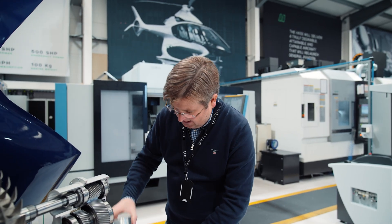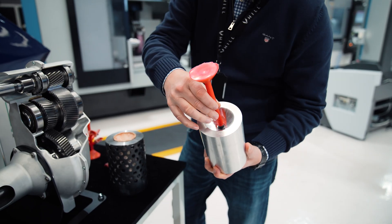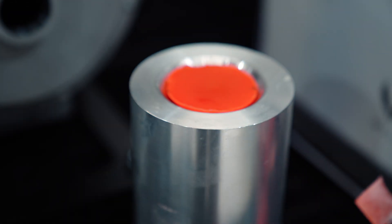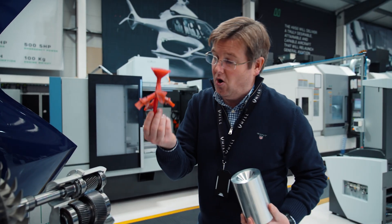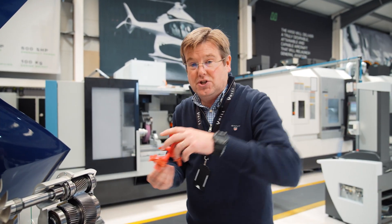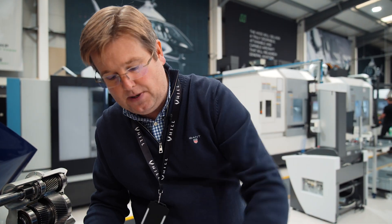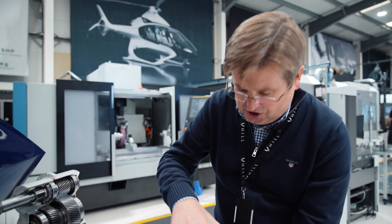What we've done this week is we've machined up a little mould — this is the mould. The wax tree gets poured into there as liquid wax. We allow it to dry and then out it comes. That can then be welded with a simple hot gun to connect the blades to it. And then once we've done all of that, we use the wax tree and essentially dip it in a batter, let it cool, add some sand, dip it into batter again, more sand, dip it into batter again, more sand.